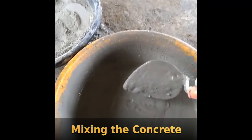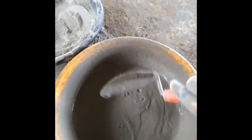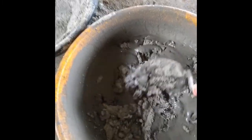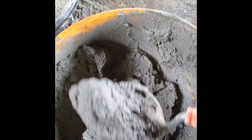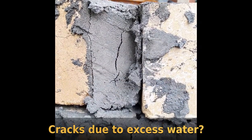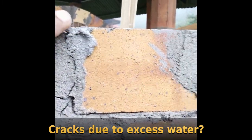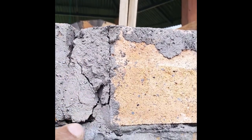Once the rock wool was down, it's time to mix the cement. Depending on the cement you're using, your mixture will change, but for me it was one part cement, two parts fire clay, and three parts sand. You've got to get the consistency right — here I'm demonstrating: this is too liquidy, so I'm slowly adding more of the dry mixture. I ended up with a consistency like a very thick cake batter. Even so, I did end up with cracks, because there was too much water in the mixture, so try to get it right.